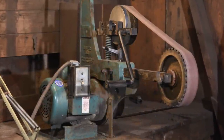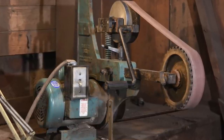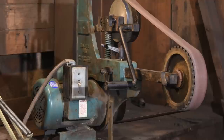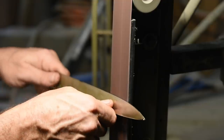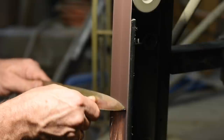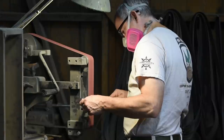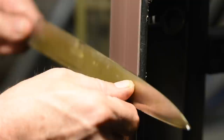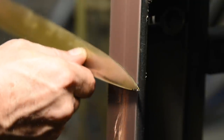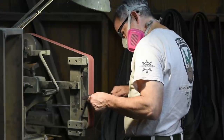Let's break down the components of the grinder to give you a sense of what you need. The first component is the frame itself. The function of the frame is to hold all the pieces in alignment so the grinder actually functions. But anytime you're working with high-speed rotating tools made for removing metal, you have to deal with something called chatter — that's the tendency of work pieces to vibrate against the cutting or grinding surfaces of the device. Chatter makes it harder to work accurately.